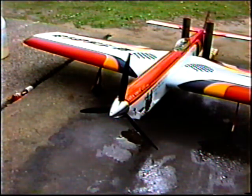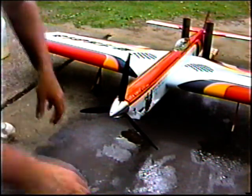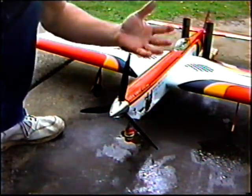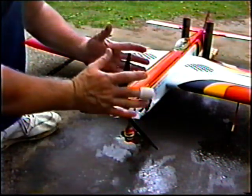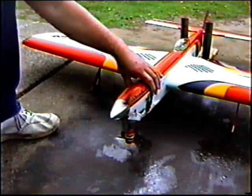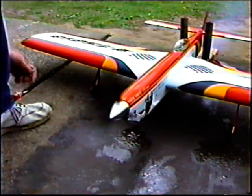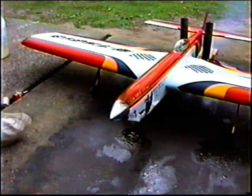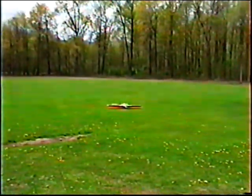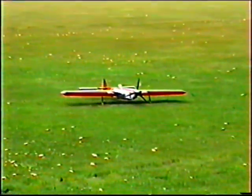Now, at last, I finally found the adapter. Here I'm telling everybody to keep such good track of inventory, and I lost the adapter. Anyway, this is Bill Lee's prop, and what's significant is this has less undercamber. So now I'm looking at the other end of this. It's a thin blade prop with less undercamber, so let's see what happens. Now, as I suspected, Bill Lee's prop has much more drive, much more thrust than the same prop undercambered.